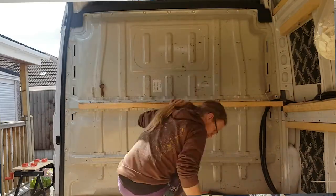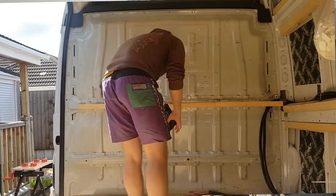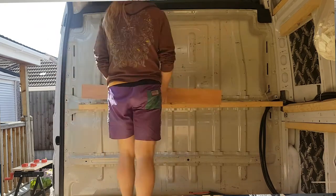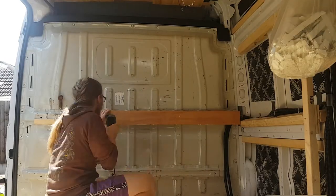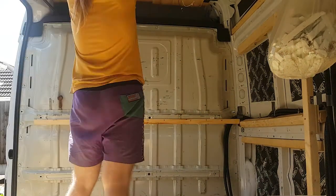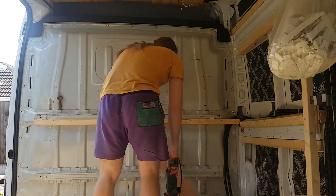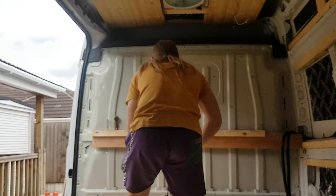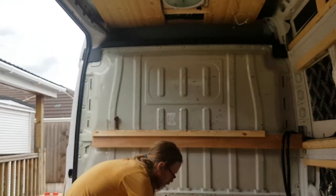Because of the light from the window it's just nonsense. So I stuck the middle piece in first — attached the batten first, then the ply over the batten, got it roughly flat. I haven't put a level on it or anything but it was a lot better than before. On top of that I created a channel with two battens — the 20mm by 45mm stuff — to run my conduit, because there are two bits of conduit coming here since this is where my desk is going to be.